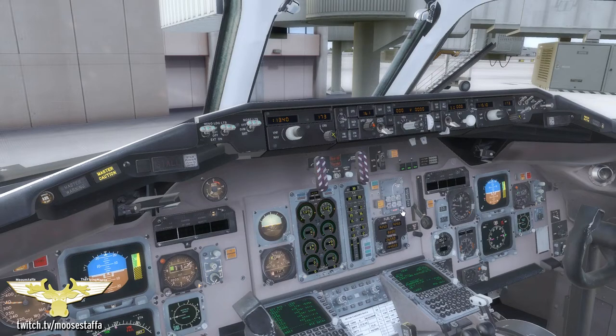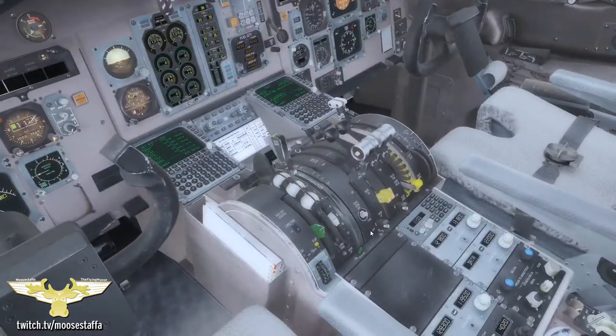TRP is tested. That was this guy down here. Fuel quantity, we checked that, is 26.55, close enough to our 26.6 with its rounding numbers. Altimeters were checked and set at 29.69, 29.69, and 29.69, all three. Fuel shutoff levers are these guys down here, and they are off.